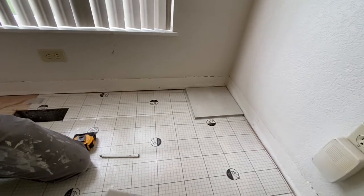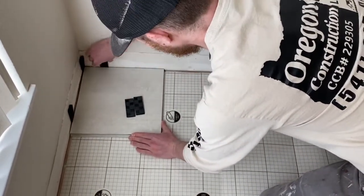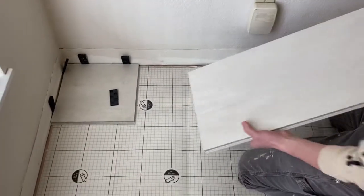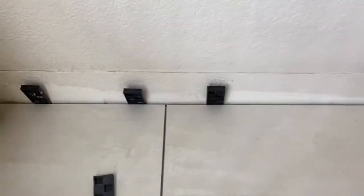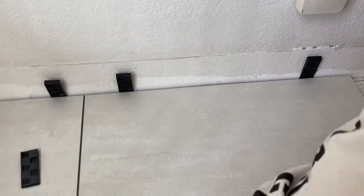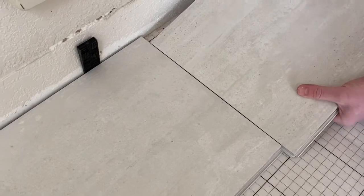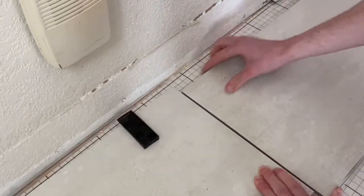Now that you've got your tile snapped, you can start laying. Get four wedge spacers in the corner so you've got your spacing. One person feeds tiles while the other sets them. Keep the tile at an acute angle — about 30 to 45 degrees — then set it into the line and it clicks right together, leaving a nice grout line. Put your spacers in, keep rolling with tile, making sure the shoe's always facing out. If tiles don't butt up tight you can slide them into position.